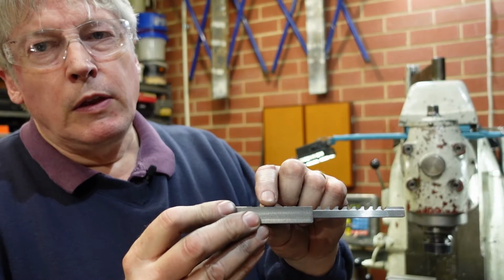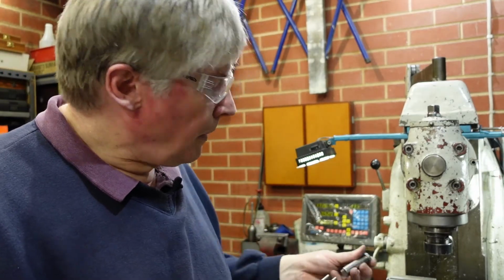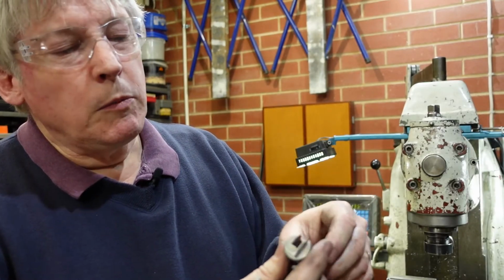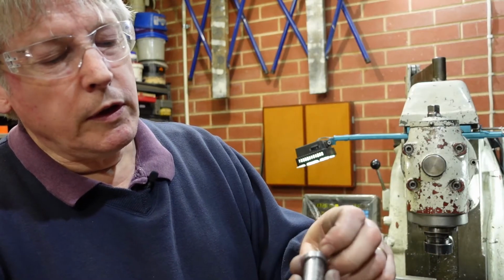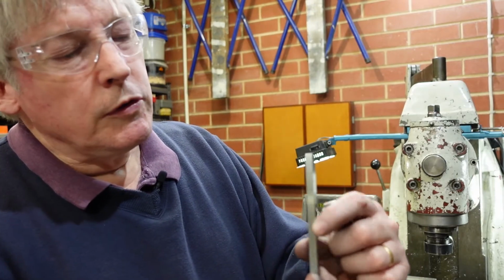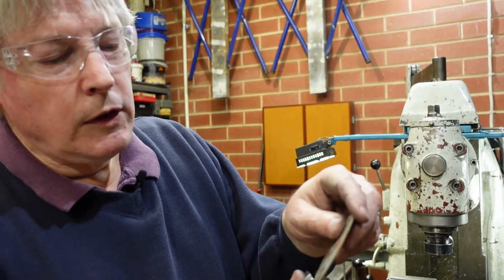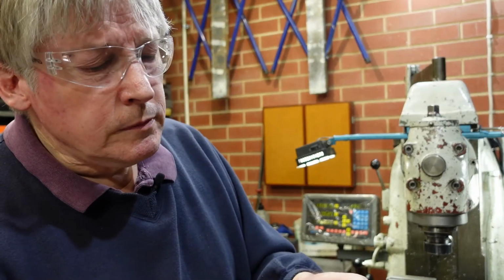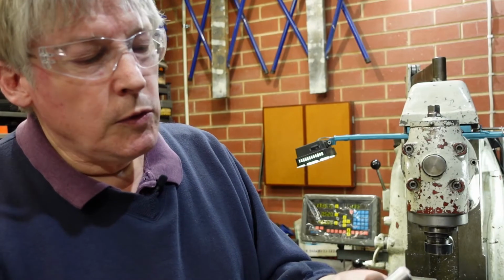And as you can see, the broach doesn't take much out, so you've got to do 2 or 3 passes with that. Similarly with this one, the depth just has to be enough to clear that so it doesn't interfere with the bore. I've put a little chamfer on the corners there and there, so I can get a screwdriver in to get that out, because it is a tight fit. One thing I had to do, as you may be able to pick up, the broaches have got sharp corners on them. So one thing I had to do was run one of the thin angle grinder discs just down there to clean up the corner, make sure that I had clearance there. Probably could have used a Dremel, but the angle grinder was closer. But as a result, I've now got an adapter which will enable me to put a B1 size broach into a C size bush.